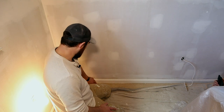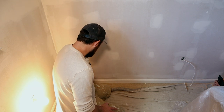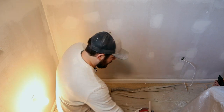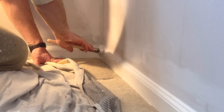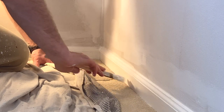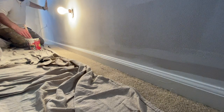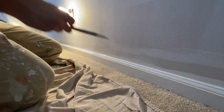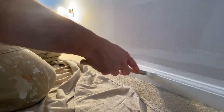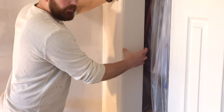We need the paint to have rolled up a little onto the wall so we get a nice straight line when we do our top coats of the wall. I'm going to work left to right — when you load the brush, don't start it too close to the wall or any edge. Start it in the middle. I generally brush toward the bottom and then do one pass over it once my bases are covered. For the closet, I'm just going to take the paint to the inside piece of the frame right here.